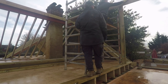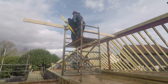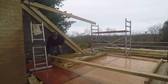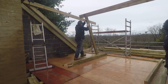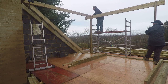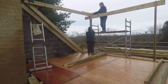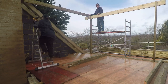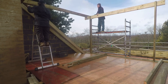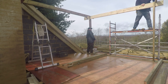Levelling up, cutting the first timber, making sure it all fits in place, and then checking the levels at the midpoint before cutting too many pieces. Once we've done that we put the template together. On top you've got the lintel slash wall plate - basically a lintel running all the way along - going across the openings for the doors and the window across the back area. That's 170mm on-end timber, just making sure we get the height in there so that we have the 2.1m for the door openings. I think it's about the hardest bit getting started - once you've got a bit of structure up you can build from it.